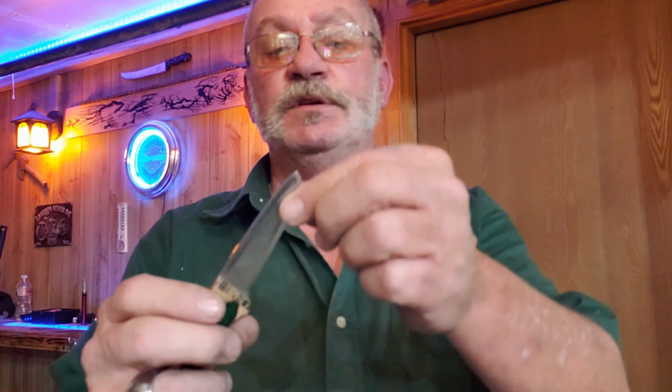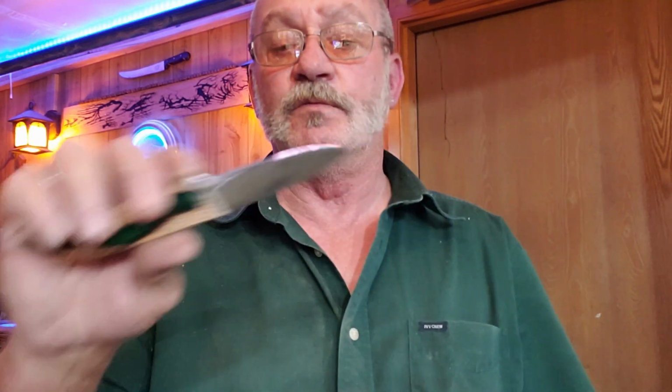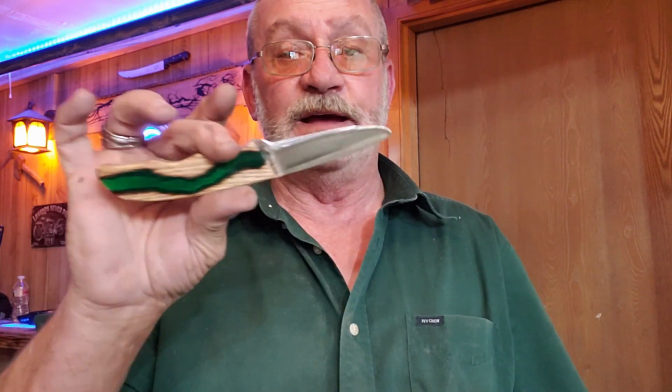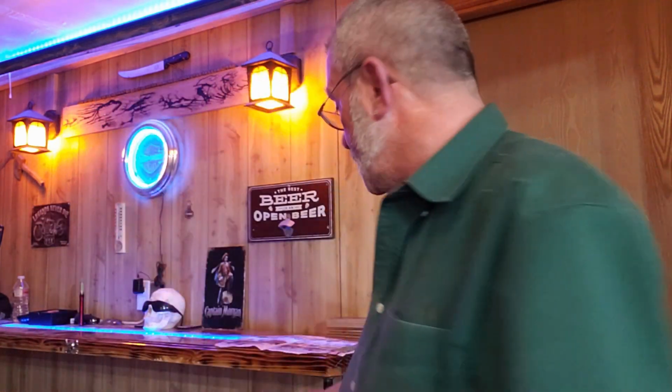You have to be careful with it. You don't get it too hot when you're grinding on it or whatever. Make sure that you don't ruin the temper. But that's all we did with this one, and that's what we'll do with a knife for my buddy Scott's wife.